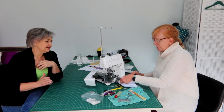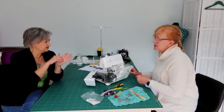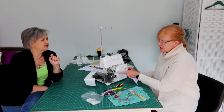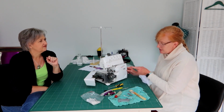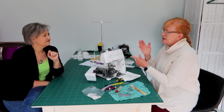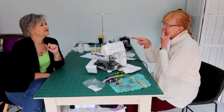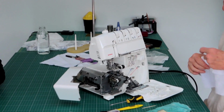And with that skimming, that's where the problem came, where that build up in that little section. And then I'll show you just now, I'll explain to you about the blade and the movement of the blade, and when there's the gap then what happens. Okay. It's very dangerous because your loopers bash. You crash your loopers when the little pieces of offcut run in there. Yes. And you eventually then end up replacing your loopers.